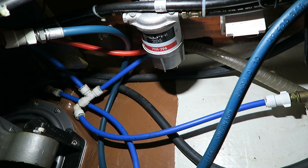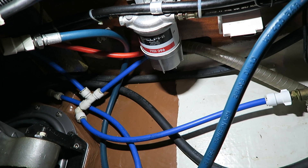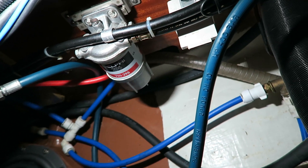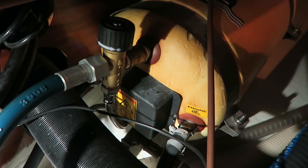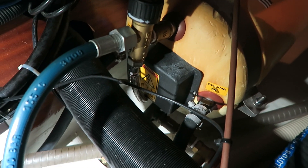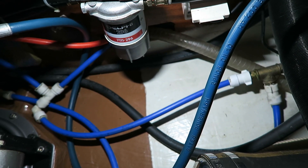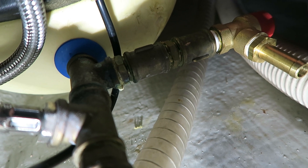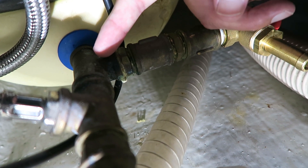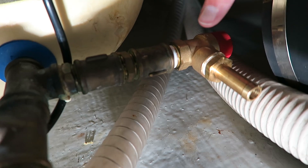Something that is missing on my system is a one-way valve on my water heater. The reason for that one-way valve is that when the water heats up it will expand, and it can expand into the cold water side of the system, which is of course not good.